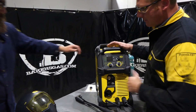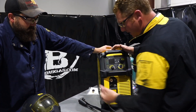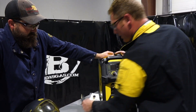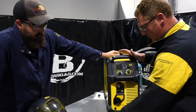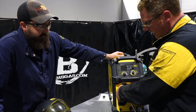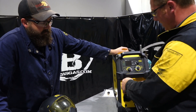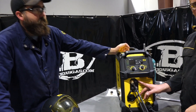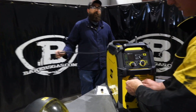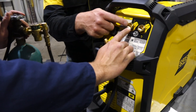First step is we want to hook the spool gun up to the machine. I'm gonna have to disconnect my positive lead. This is running the standard MIG process, and you can leave the MIG gun connected by the way — we just took it out to make it easy to see what we're doing. I'm gonna connect my lead from my spool gun to the positive — it's a twist lock. I'm gonna connect my remote current or trigger lead voltage to the spool gun, and then connect the gas line to the spool gun on the front of the machine. On the back of the machine, I can actually leave my standard MIG gun hooked up and leave my spool gun set up.